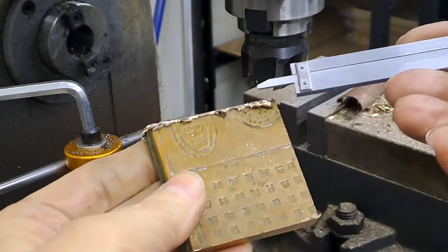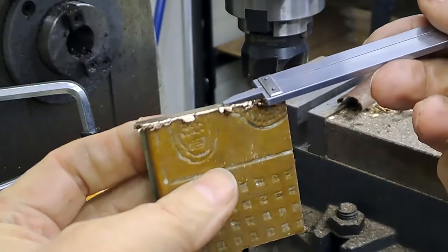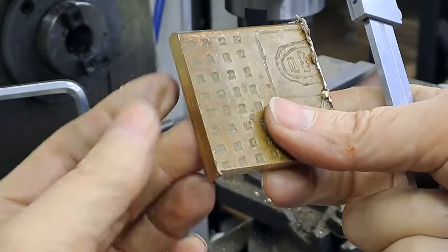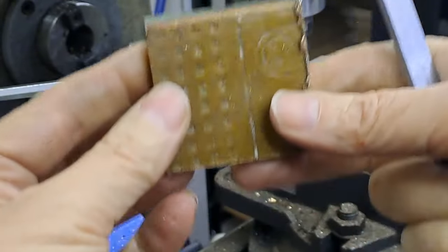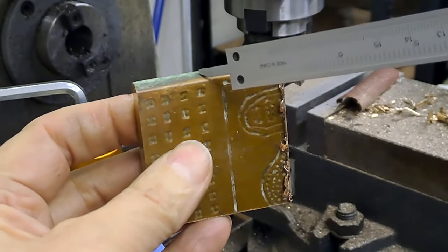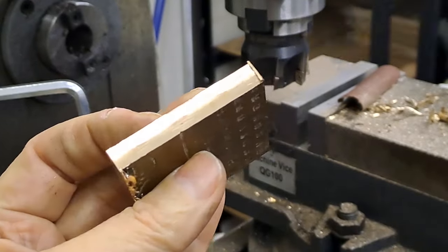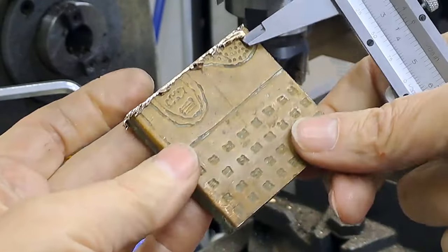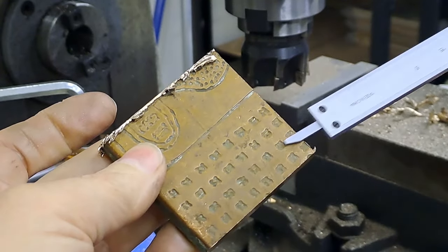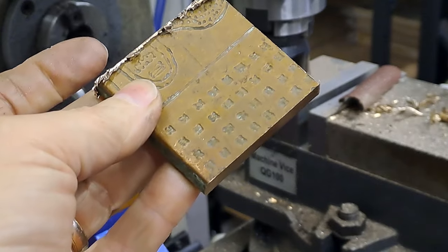I've just got to get all these burrs off, smooth it, because they'll mess things up otherwise. And then we'll get it set up square, get a square up against this, and get it in the vise. Clean this top surface off, neat and tidy. Flip him around, get rid of that sawn surface, and then we'll end up with our block that's 55 by 45. All right, guys, give me a tick. There's no point showing you the filing. I'll do that off camera.